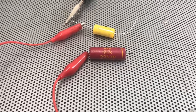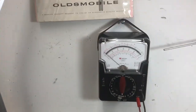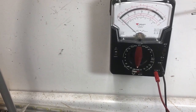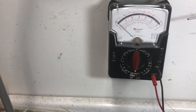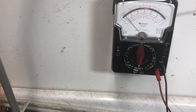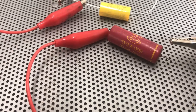If you get something like this, I'm going to look at the ohmmeter, and I want you to notice the typical bump and then back down to nothing. But I also want you to know I've waited a few seconds — bump, it's back again. Wait a few seconds, bump, it's back again. So what does this indicate? It indicates that the capacitor is charging up, and then as soon as I let go, it's self-discharging.